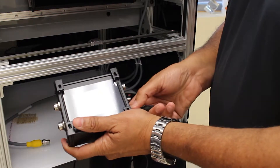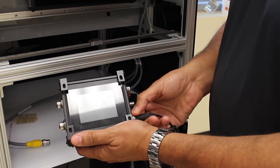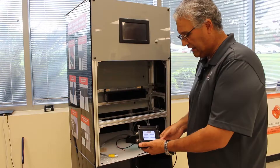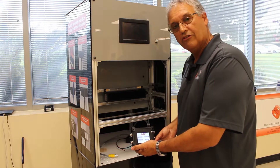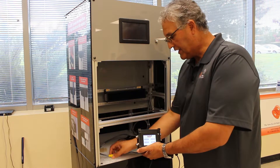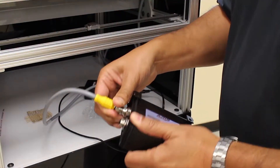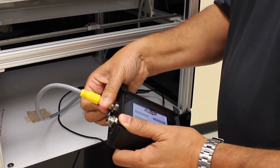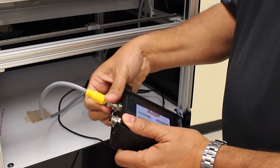First I plug it in to a 24V DC power supply. And right now I have placed the ARIS WPS 221 IR sensor, which is a 221 millimeter sensing window with an infrared light source. All I'm going to do is just plug it in — once I match it to the notch, I can just put it in place.